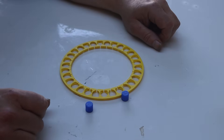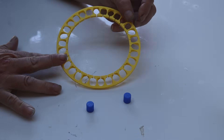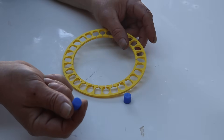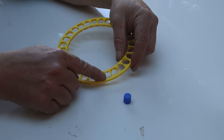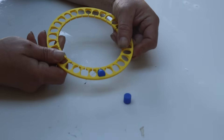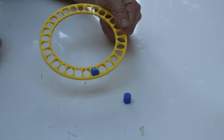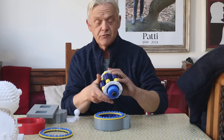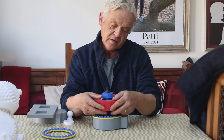This model is meant to come apart, and you don't want to be placing 60-plus rollers every time you reassemble it. So you'll find two roller bearing cages. You take 60 of the 11.5mm rollers — 30 each side — and slide them into the cage. There's a tiny step in the cage: the roller feeds in from behind into the step, and there's a split in the cage where it opens up and snaps shut to create a cage for a free-spinning roller. Once done, take the caged roller bearings and drop them into the groove, slot the roller cage into the centre, then the output wheel slots on top.